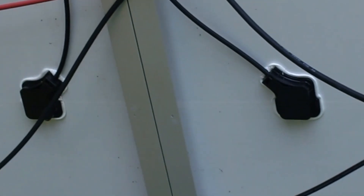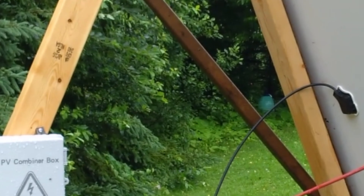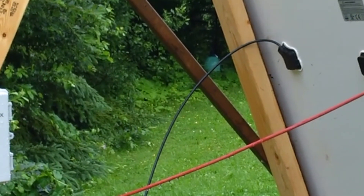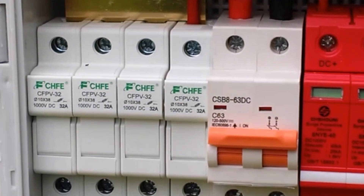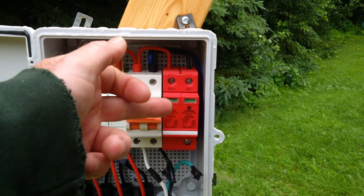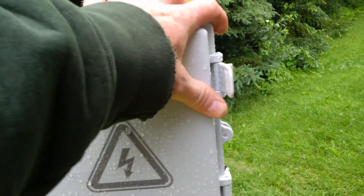This is a look at the back of the panels. They're obviously wired up in series — big mess of cables. I need to tidy it up, but it's kind of a temporary setup until I figure out exactly what I want to do. I've got them going into a PV combiner box just to ensure that the two different arrays don't cause trouble with each other. It's a nice box which takes MC4 connections on the bottom — plug and play. You need this if you have different arrays to combine them, so there's no back-feeding voltage. It comes with a breaker and also a ground, which I don't have wired up yet. This isn't 100% complete, but it's a handy, weather-sealed unit with a good breaker on the outside.